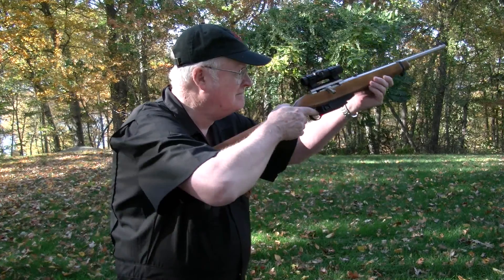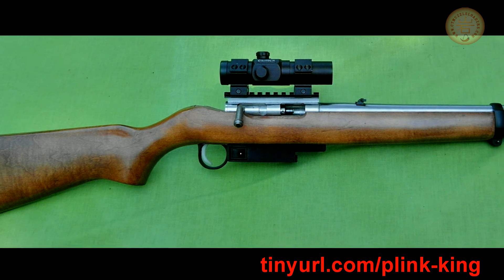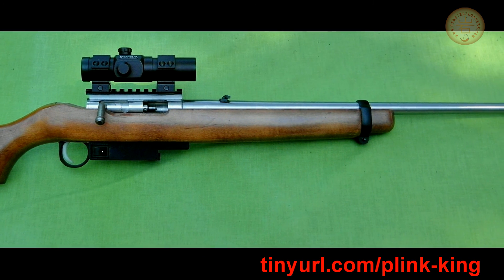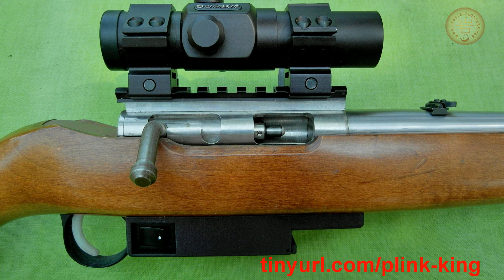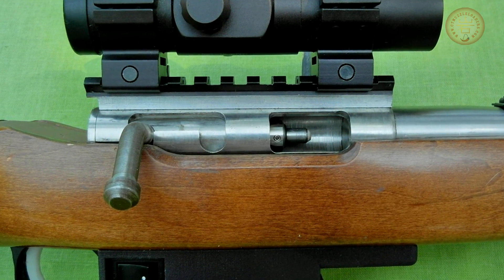Connecticut Muzzleloaders presents this project. The goal was a new rifle using smokeless powder, but smokeless has over 8 times the energy per grain compared to black powder and can easily generate destructive pressure if not carefully used. Using smokeless powder on any muzzleloader is inherently risky because the load can't be controlled — after all, how many muzzleloader shooters have accidentally double charged a rifle? Therefore, to safely shoot with smokeless powder, the rifle had to be designed so that overcharging was simply not possible.